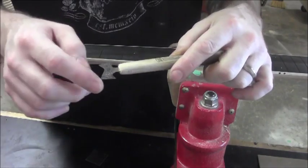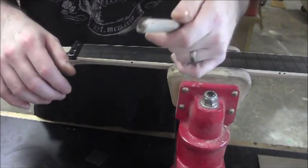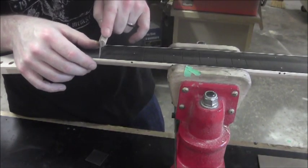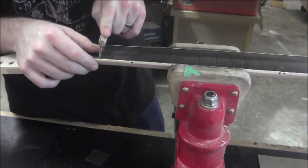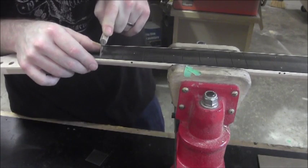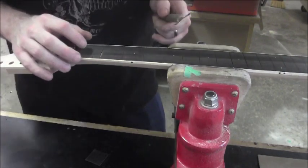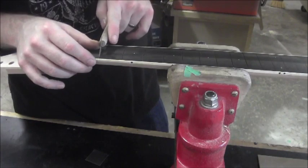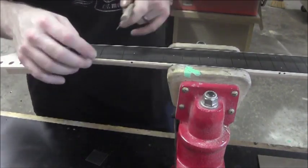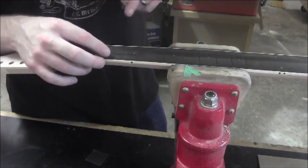You can see this tool here — it's got two sides to it so you can get into both corners without having to swing the instrument around to do the other side of the cut. It's got nice aggressive teeth on it too, so it works pretty good. We're going to carefully just set it down in our fret slot here. You can see the area right at the end that has some adhesive in it, so I'm just going to keep nipping down on it and kind of pulling away. It shouldn't take much to clean it out. We'll spin the tool around and check this corner — looks like we're pretty good to go, no adhesive squeeze-out there.